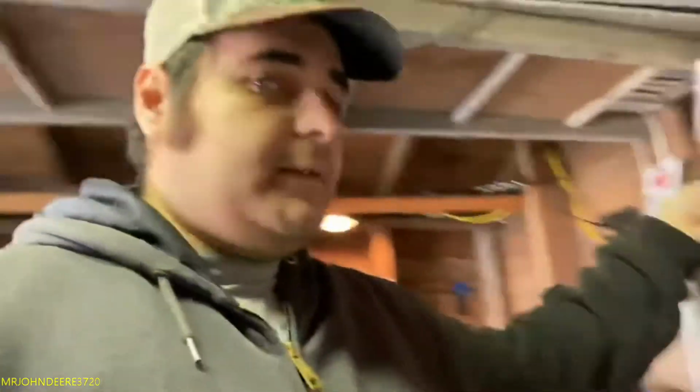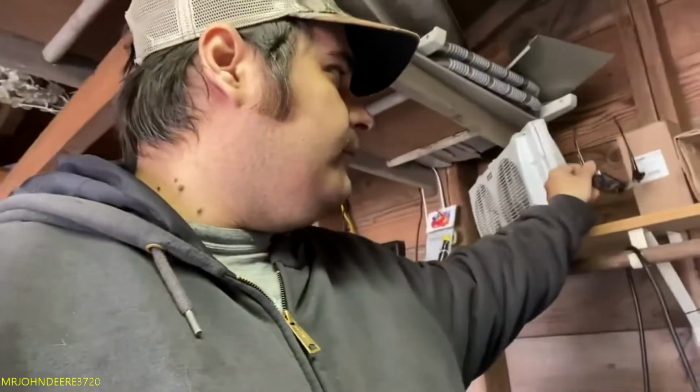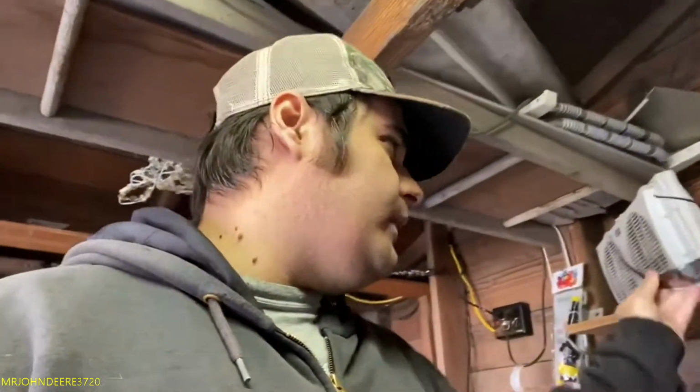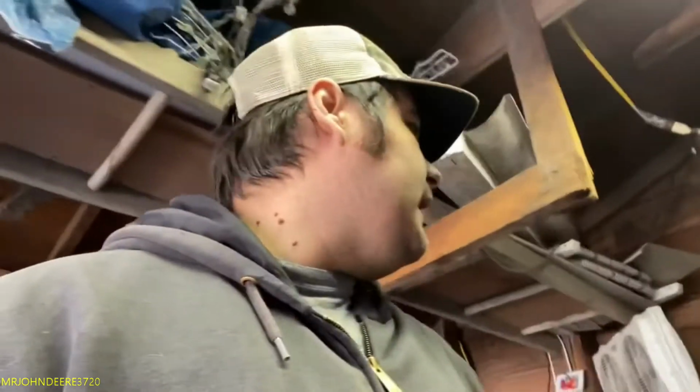But I noticed with the Case IH, and maybe Fleetguard will do it too, I don't really know, when I bought that filter, it's in the bottom of that bucket here, there's a little rubber gasket in there, and I think it goes to the cap or the drain. So I'm guessing over time the drain seal wears out, and then they give you that spare one to replace it with, so you don't have to go find a new one right away. I don't know if that gasket is a separate item number or not.